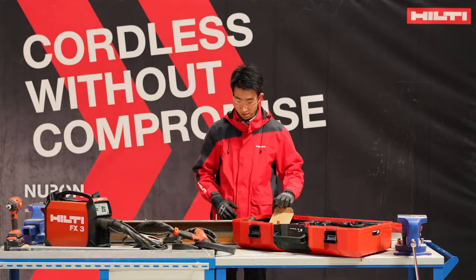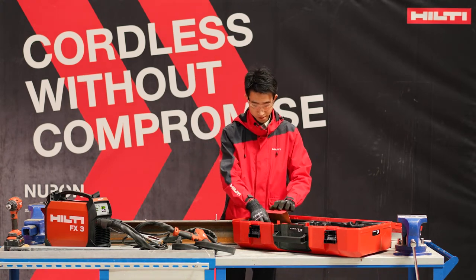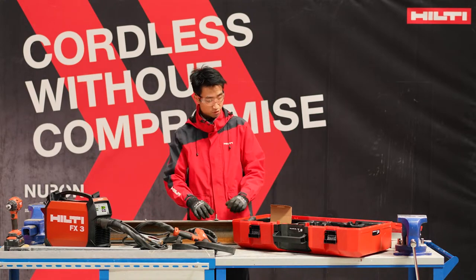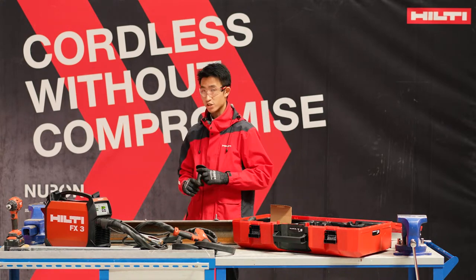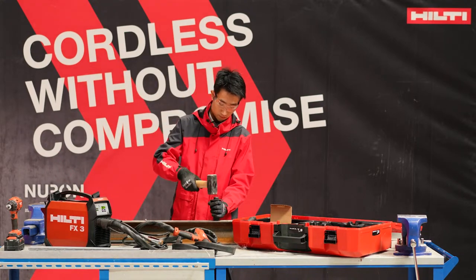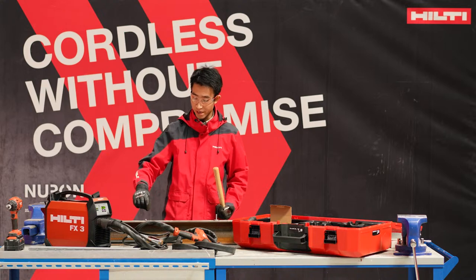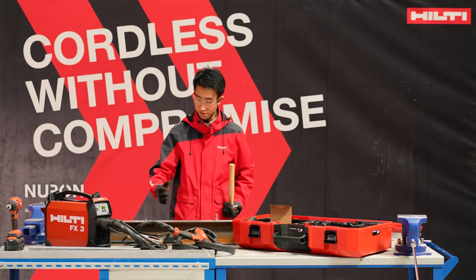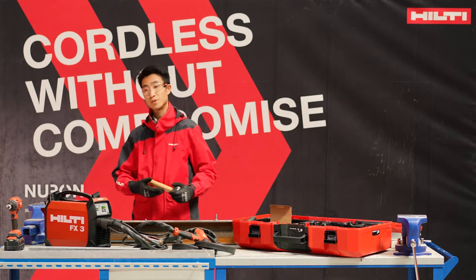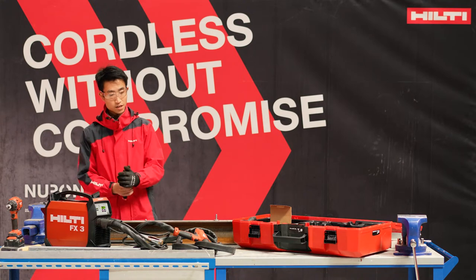Some people might also question: now that we've decoated the surface, what about corrosion protection? We also have a solution for that — we have a sealing washer. You bring it on top over the stud and then use the washer setting tool together with a hammer. That's done — so instead of having to repaint the surface very carefully and taking a lot of time, this is so simple that one hammering is all you need for corrosion protection.